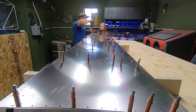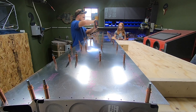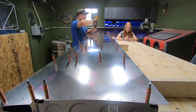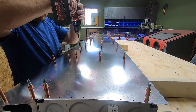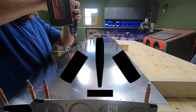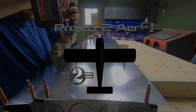And I think that's where we're going to leave this one. The skins will come back off so we can clean up all the holes that we just drilled through the spars. In the area where the stab meets the fuselage, there's a fairing that will be installed later. In the next video, we'll be countersinking and dimpling the skins to allow for flush fasteners in a few spots so the fairing can sit flat on the stab. We'll follow that with a quick inspection of everything that we're about to cover up and close this part out for good. Thanks for tuning in, and I'll see you on the next one.